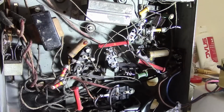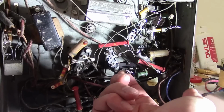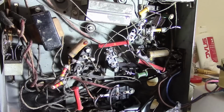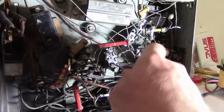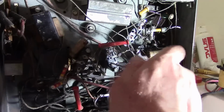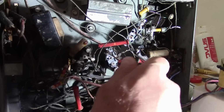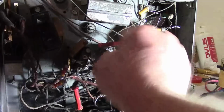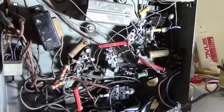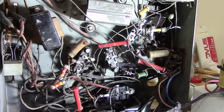Cleaning off a solder blob from some other old repair. Whoever soldered these on did not do a very good job. That also looks super crudely done. But in this case it was to our advantage. So now let's go to our new technique of we're going to twist away. And get this guy. This one's tough because that lug is bent over and there's a lot of chunk on it. Now let's work more on pulling that lug off before we proceed.